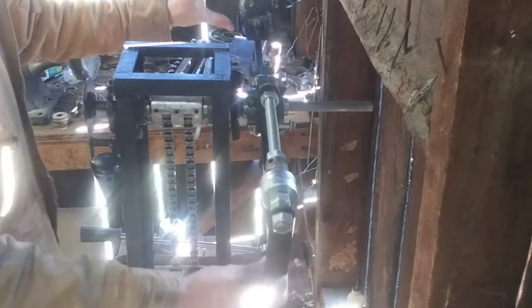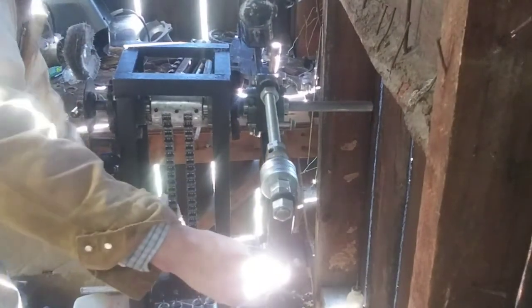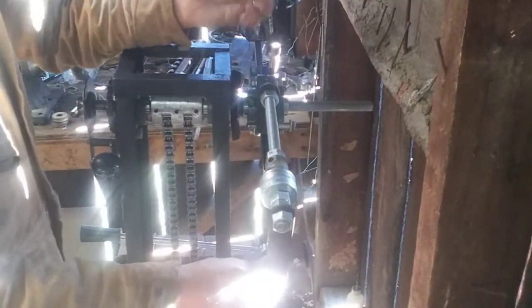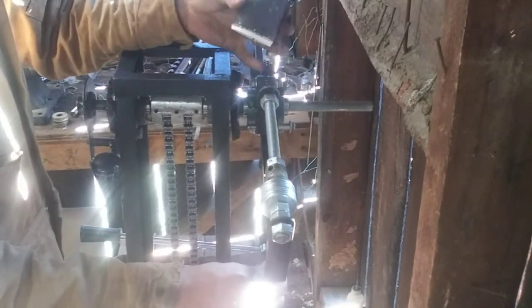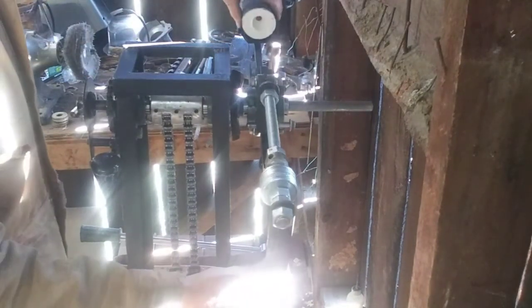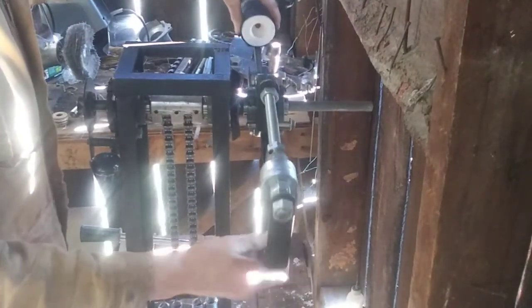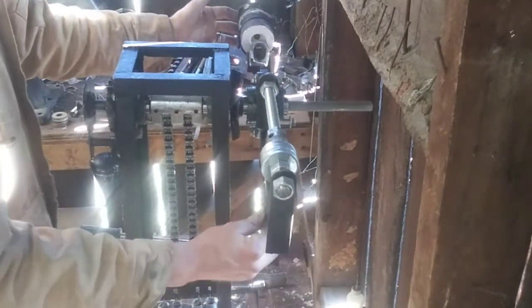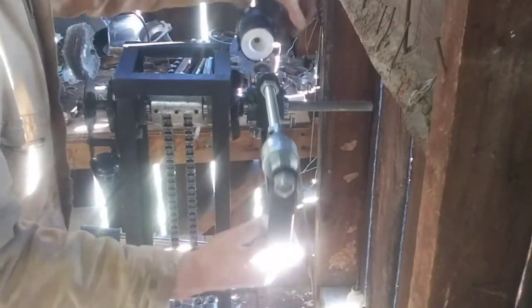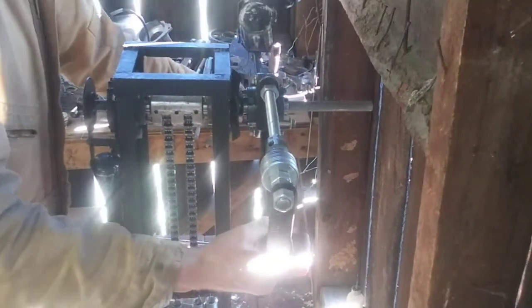Over here on the end, this is the mold holder. This is where I would put a mold that you're casting. This is what we're going to cast here in a little bit. There's a mold of a ring in there made out of wax, and we're going to be casting it into 14 karat white gold. That would go right there, and then you have your little latch to lock it in place, so now that's not going anywhere. And the crucible would go right here, and you can slide that forward and backward right up to the mold. We're going to take that out for now, take our crucible out because we don't need it right now.